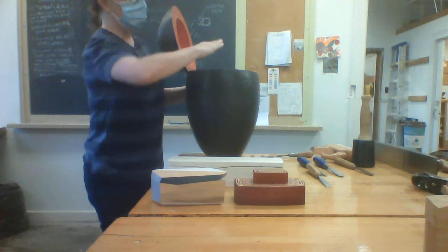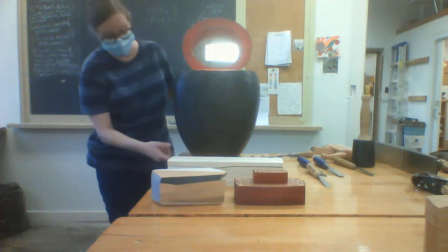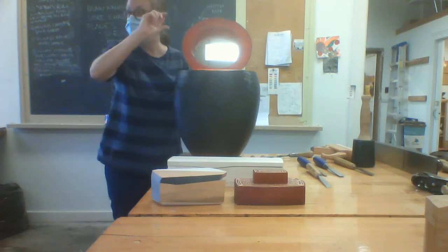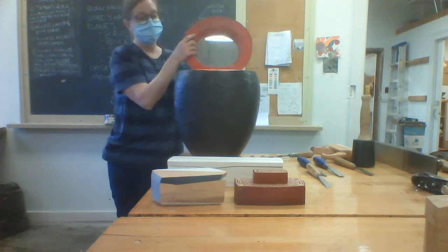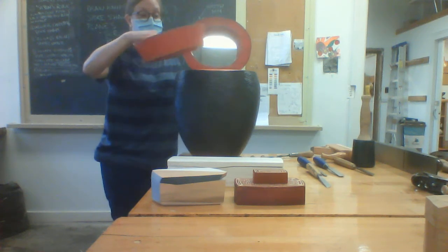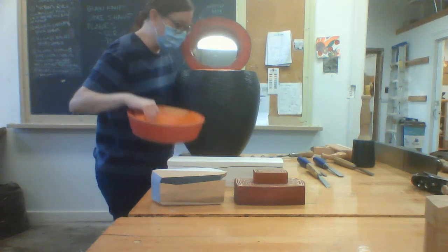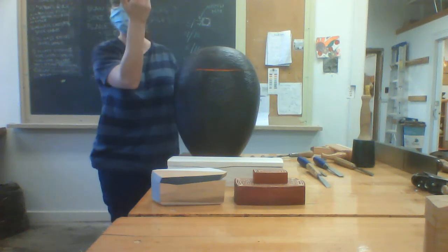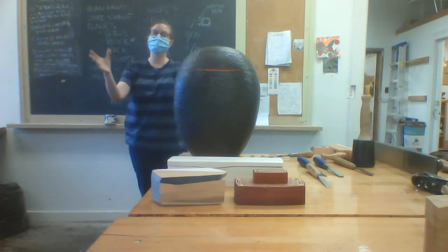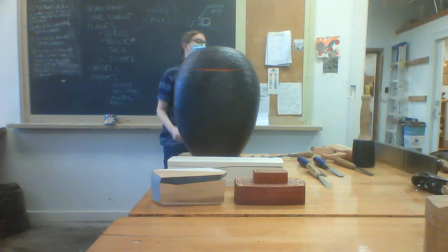And if you look at it, it's glued up in layers. Lots of layers of 12-quarter poplar, all the way up. This is made of its own two layers. This all by itself, this was one layer. You'll be able to see how it was constructed just by looking at it. And I used a big angled cut in order to make it so that things would nest and rest. And I hollowed out my insides, glued everything together, and then shaped my outside.